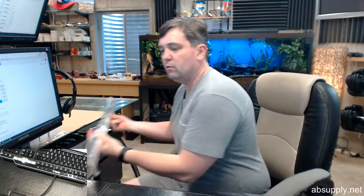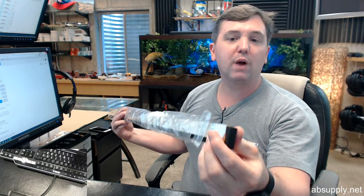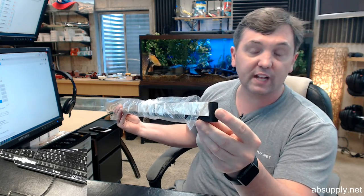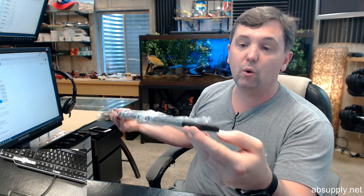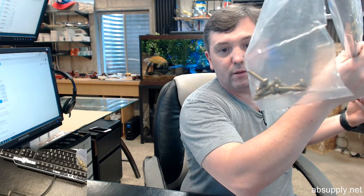Why would you want that material? Well, if you want the cost, of course, a piece of extruded bronze like this is certainly going to cost more. I'm going to make an attempt to give you the thickness of this material as best I can. About 75 thousandths of an inch thick on this piece of extruded bronze, whereas that roll formed would be probably less than half of that thickness. Now this material is held on with an adhesive, that's what's there. It's also held on with the screws that would be provided, and they are solid brass screws as well.